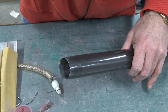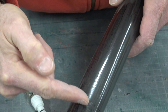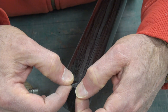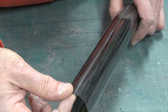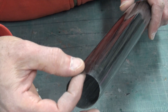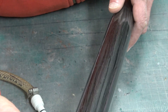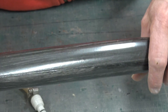One of the things I wanted to do is cut it where I put in some fibers that run this way — the purpose of that is to prevent it from tearing right here. Those fibers are really strong and I don't want it to tear because this is very thin. If I put a caliper on it, I bet that's like 0.008 or 0.009 inches right there, with a little bit of extra thickness because of those extra fibers. So I've got fibers going that way to prevent tearing, and then I've got these long fibers along the tube that give it longitudinal stiffness.